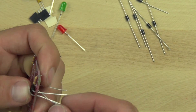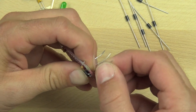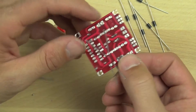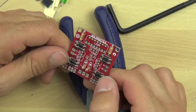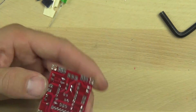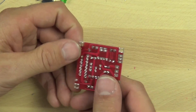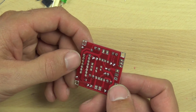It's important that the components on the board sit flush. Bend the leads out like we did with the other components and make sure they're all lined up appropriately. Keep the leads away from each other — you don't want them touching when you solder them down. Verify that the leads are there and that the diodes are flush against the board. Solder them in place and then add the other six diodes required for protecting our board. Once those are all soldered down, trim off the leads, making sure the solder pads don't connect to each other and that all solder joints look good with no bridging.